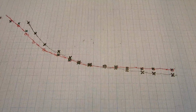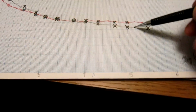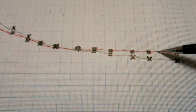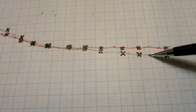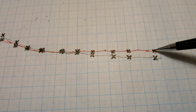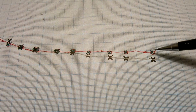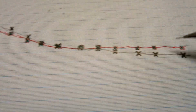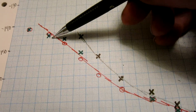Here are the results of my first measurements. The lower trace is at full power and the red is at 3 decibels less. Plus 12 dBm input and plus 9 dBm input. And of course, at wide range the noise figure dominates, and therefore lower power is less good. At close range, lower power is much better.